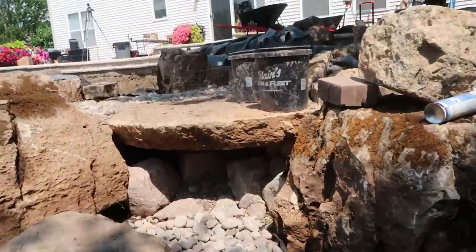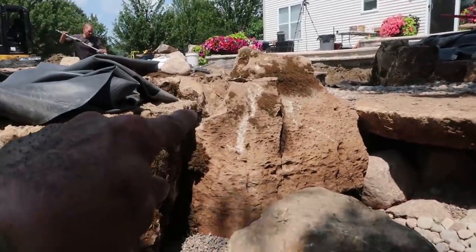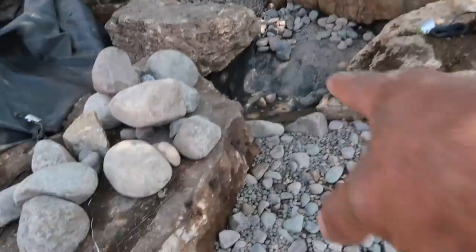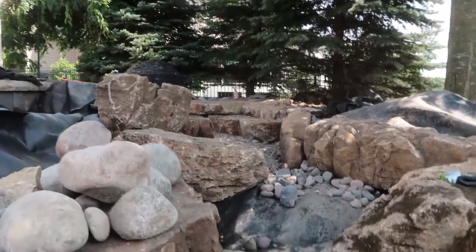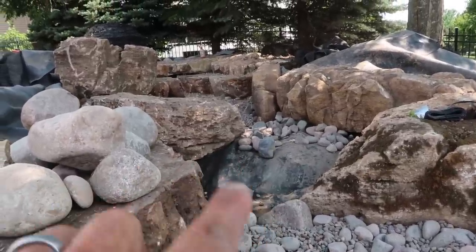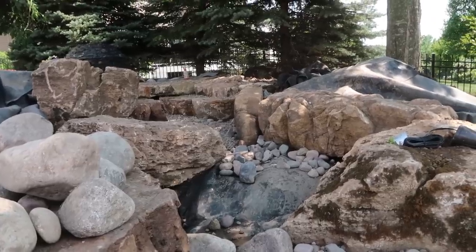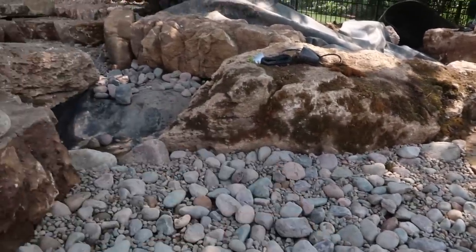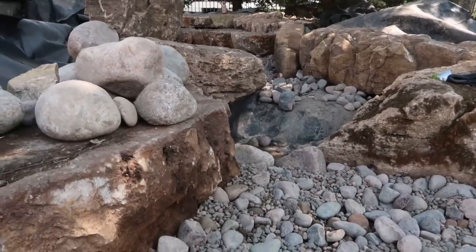There is a spillway up there as well. This is that spillstone that Jack was just talking about — about a three-and-a-half-foot wide spillstone — where all the water is going to overflow. We also have a little secret falls right there that will pull off a little gravity feed. We still have to dam up this portion of the stream — I want to drive the water level up so we can get the bottom of those rocks underwater. This little waterfall is very important to set at the appropriate height. Corey is going to do a cobble landslide and foam in between all those cobbles for a bubbly brook, rapid whitewater look, which will also push stuff further out this way as opposed to immediately going over the negative edge.